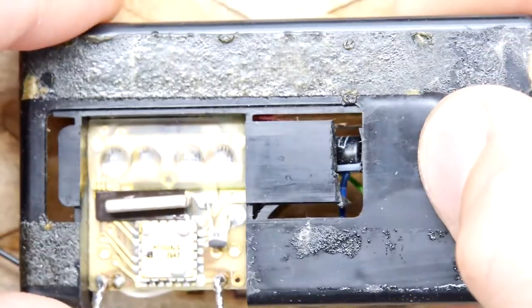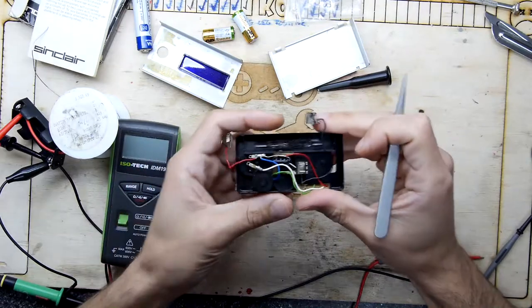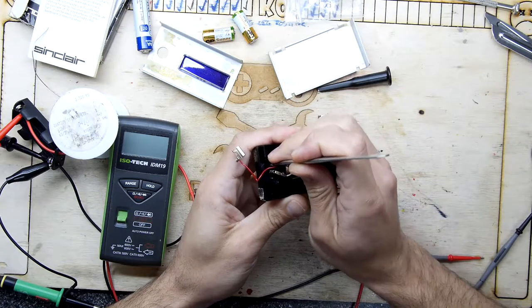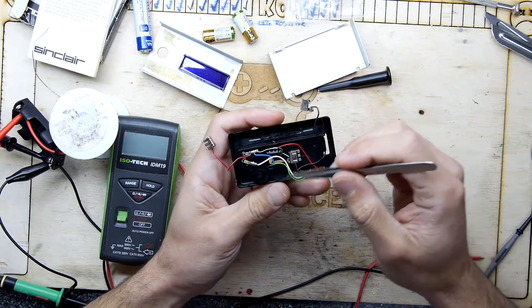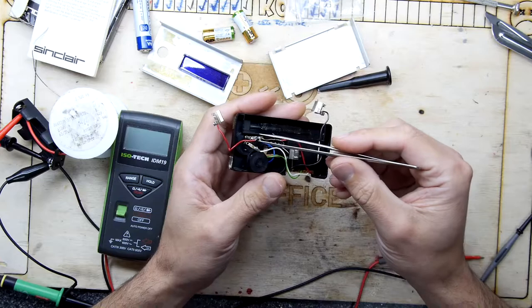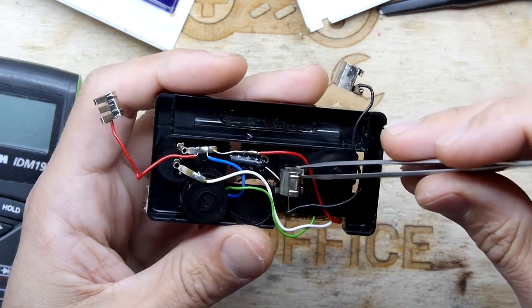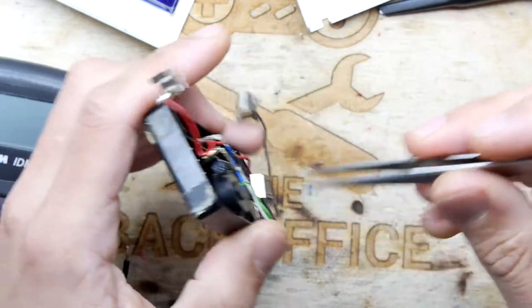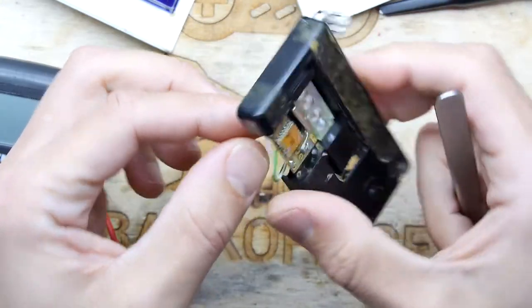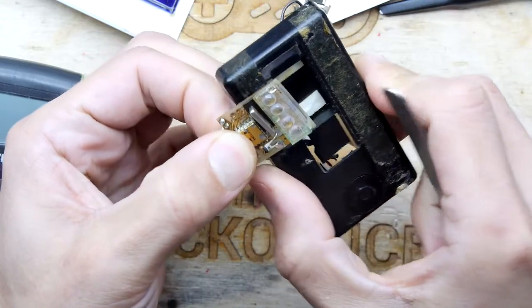So Billy, I'm guessing you said it was doing something — I can't get it to do anything right now. So continuing experimentation: I spoke to the owner and it most definitely came on when you pushed one of the buttons, and went off when you pushed the other. So I've decided to dismantle it a little bit further. They've got these interesting button modules with press-on contacts that you just push — reasonably serviceable. I wanted to get the whole thing off this plastic carrier and get the PCB out to check behind the board.